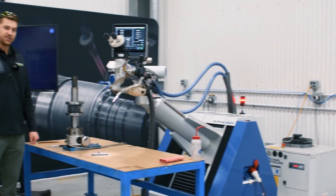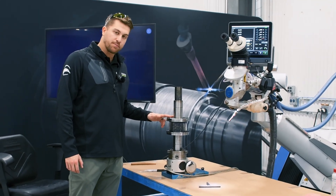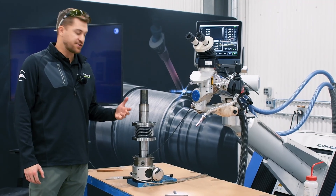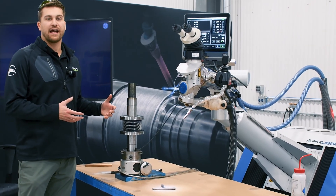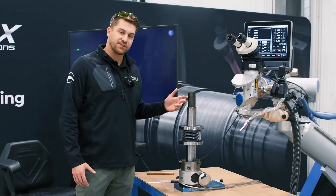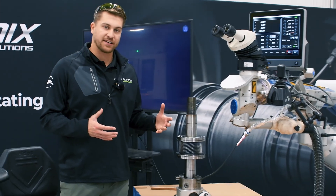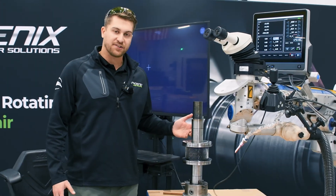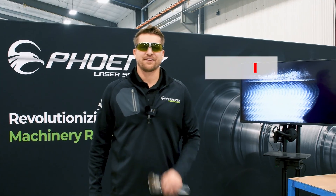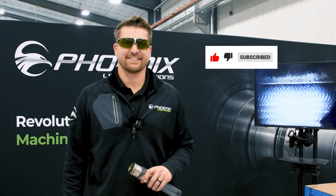Alex just finished welding this and as you can see it's slightly warm to the touch, but the customer wanted to go with laser welding over conventional TIG to keep that heat input at a minimum, so you wouldn't have to worry about any distortion or warping issues of that pinion shaft. A lot of times run-out can be a big concern with TIG welding — with laser welding we were able to eliminate that entirely. Thanks for checking out another episode of Beyond the Weld, please like, subscribe, and leave a comment for us. Thanks.